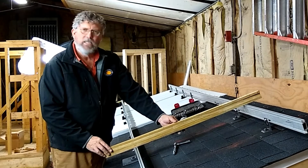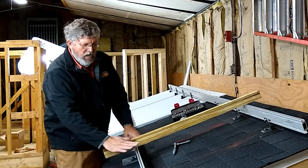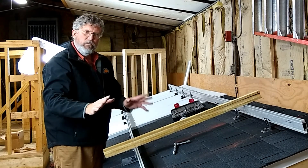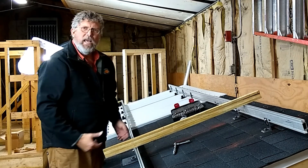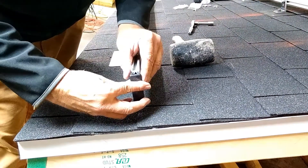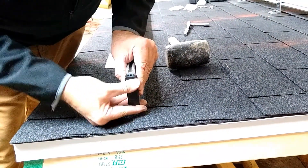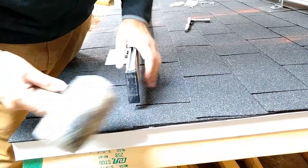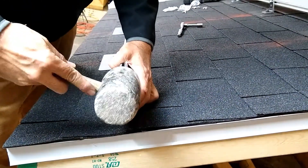One point I want to make is with two rails it doesn't really matter to get them properly level, but I like to use a rail that hasn't been installed yet. If you've got multiple sections going down the pitch of a roof, lay an unused rail across so that all of these rails are uniform and come up to the bottom of it — that way you don't get a meandering level when applying your panels. You may have to leave some footers loose to raise or lower them for a nice uniform look across the entire array. Most rail systems offer an end cap for the ends of the rails to trim it out and make it look nice. Install those with a rubber mallet, though some end caps may have to wait until after mounting because they can block the grounding lugs or end bolts for the panels.